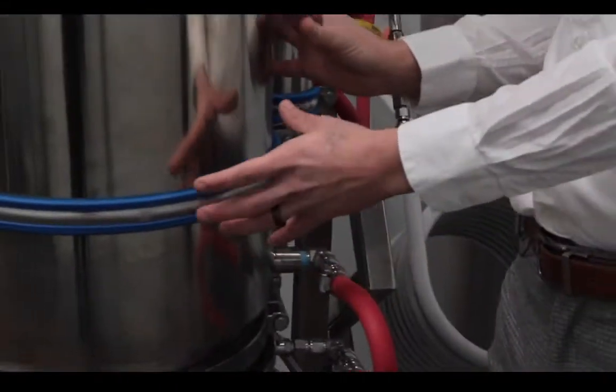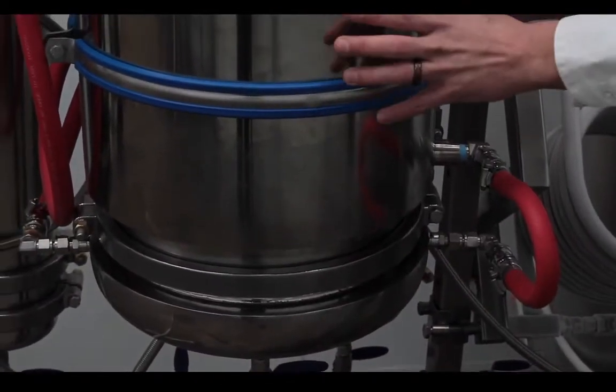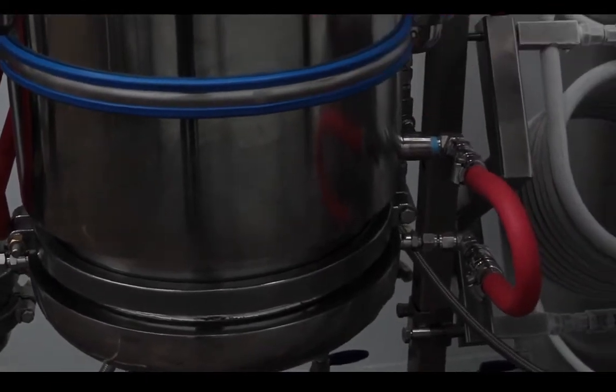The heater is supplying our solvent recovery tank and our collection pot. That's keeping everything at 115 degrees Fahrenheit to enable the boiling off of our gas into the vapor phase during collection.